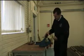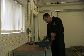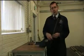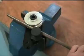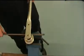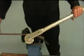To begin with we're going to take the forming die and secure it in the vise. We're going to measure out 120mm from one end and mark that position with a pencil. We'll fit the hydraulic pipe into the pipe bending equipment so that the line we marked at 120mm from one end is aligned with the pop mark on the forming die and the pop mark on the bending equipment. Next we attach the pipe bending handle and force the handle around, bending the pipe to 90 degrees.